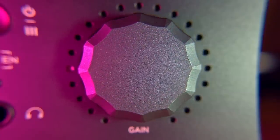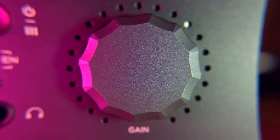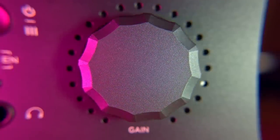It's the same sort of sound that you might sometimes hear turning certain units on or off, particularly with active monitors. And the reason it's an issue here is that this gain control is actually placed after the input stage. When you combine the fact that it's after the input stage, in other words, it's a part of the amplification circuit, you could say, combine that with the fact that we're running a zero feedback design, so there's no feedback to try to remove any noise that's introduced, and what you get is that little bit of a click every time the relays change the gain level, that click has no way of being removed in a zero feedback design. And so the result is that we do hear little clicks and pops. But this is where things get a little bit nuanced for me.